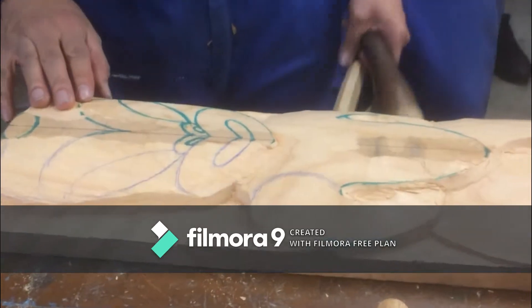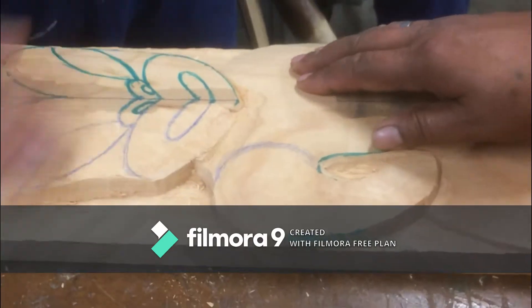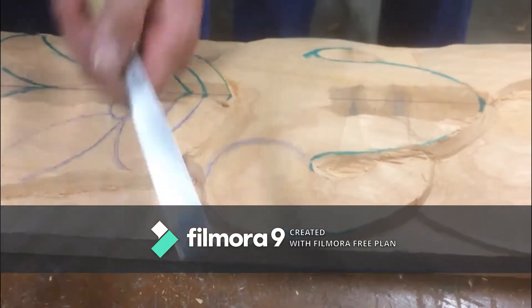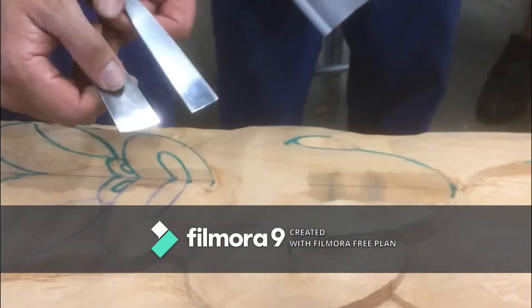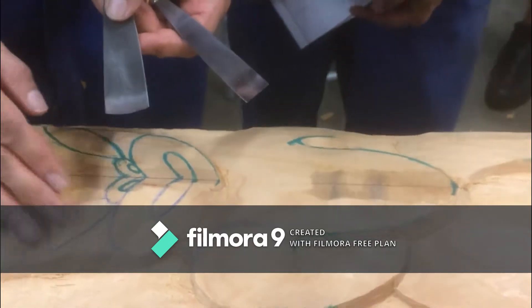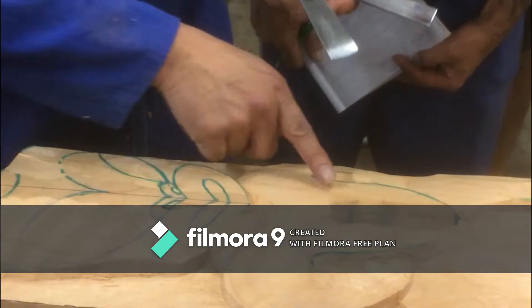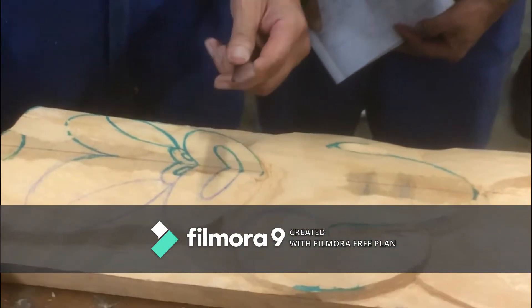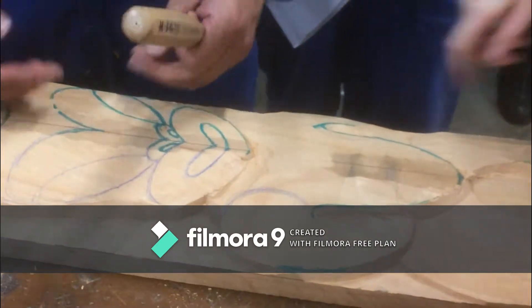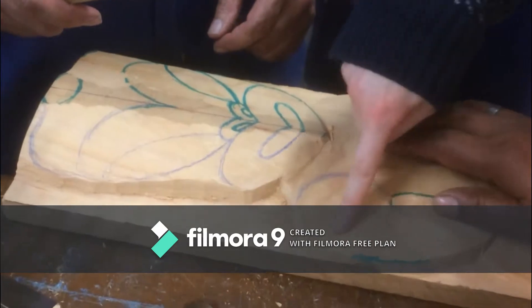So what I'm trying to do is when I prep this one, I'll be straight across. But my chisel has a curve on it — have you noticed the difference? It has a curve. What that means is that it'll slice the wood on both sides, so there'll be less scratches along here. If I try to do that with a straight chisel, I'll get all these scratch marks and run the risk of splitting along here, and this whole thing could break out.